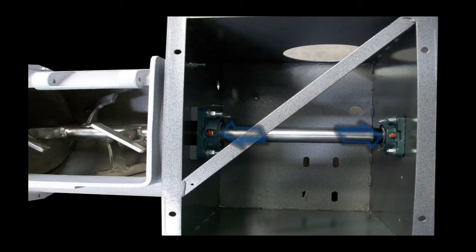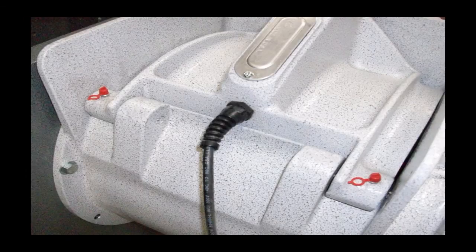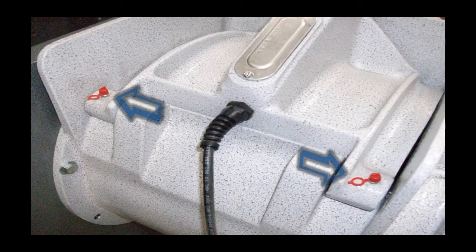One pump of standard bearing grease is all that is required to maintain proper lubrication of the front and rear bearing. While the top cover is removed, confirm the chain is properly lubricated. Apply chain lubrication as required. Do not use WD-40. It is also recommended that the handle bushings be greased. The same procedure for re-greasing the handle bushings should apply.